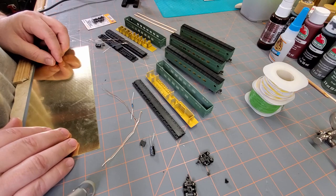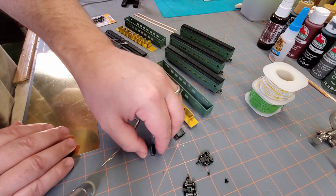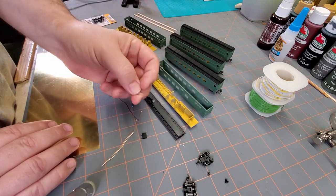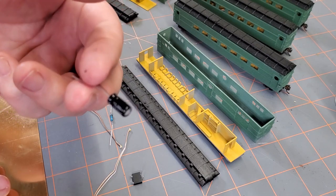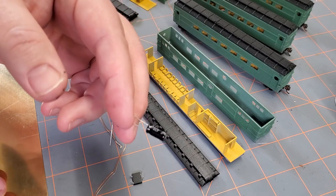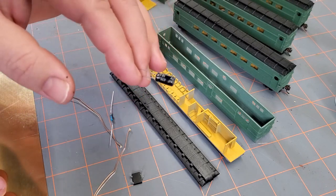To do it as a more polished and finished product — something like you'd buy off the shelf — you're going to need a capacitor and a bridge diode. A capacitor is kind of like a little power storage device, similar to a battery, but it expels its power just as fast as it comes in. When you're running over bad spots on your track — connections, a dirty spot — this capacitor will store enough power to keep your lights lit and steady.